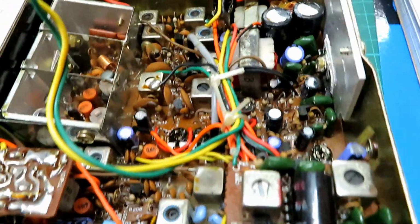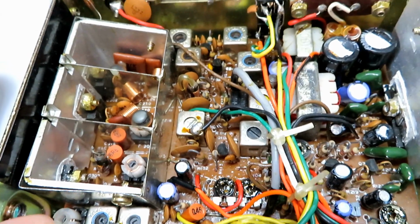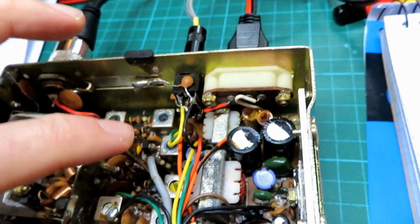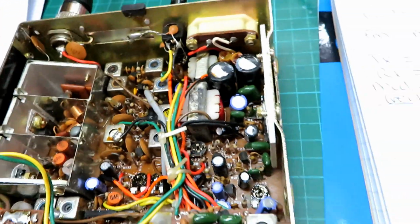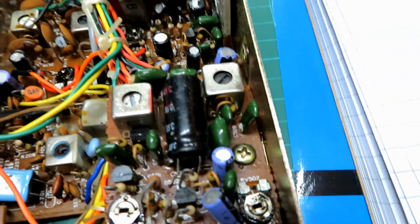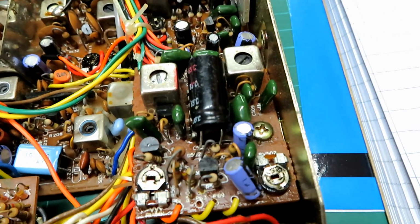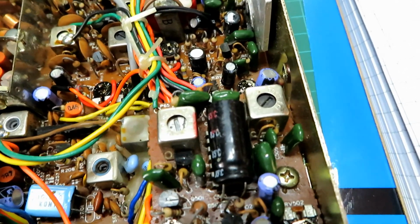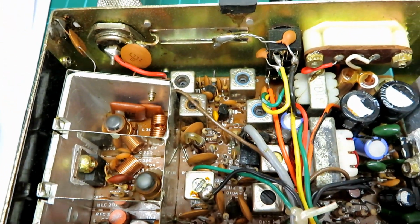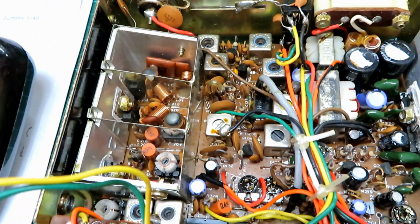So I'm thinking on transmit, we're looking at this array here, these 3 in the front end, and then these in the power section for transmit. And I think all of these others are going to be on the receive side. That'll be the VCO. We're not going to touch that. I think this will be on the AM side. Again, if it's within spec, I'm not going to touch that, because I could very much make that worse if I don't have the details on how to do that. Yeah, we'll move on and see if we can peak the transmit power.